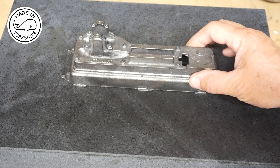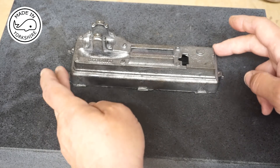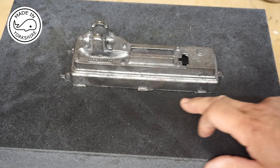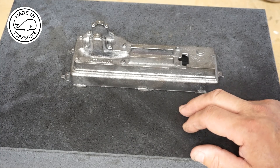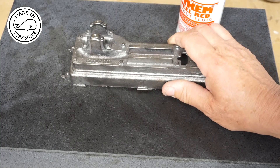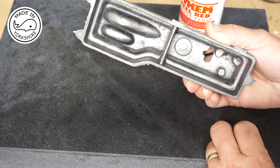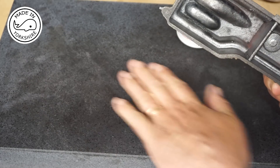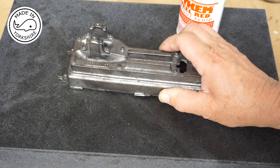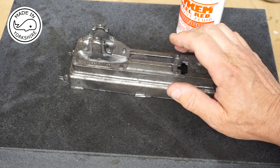As you can hear there are some high spots on the base of this sole plate. I think the high spots are these corners, and it also needs tidying up around here, maybe with a file or something. I'll just go over it with emery paper to identify those high spots and then work out how to address them.